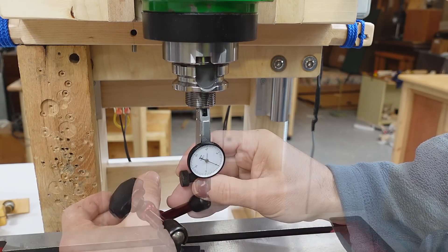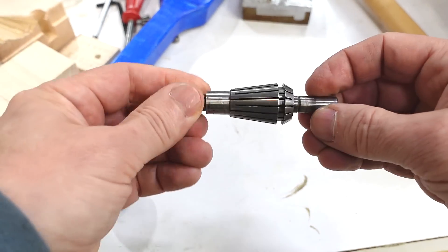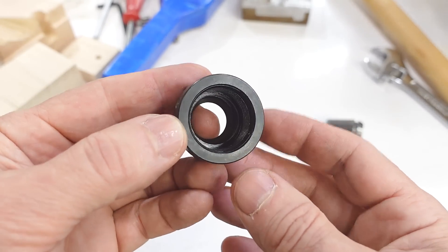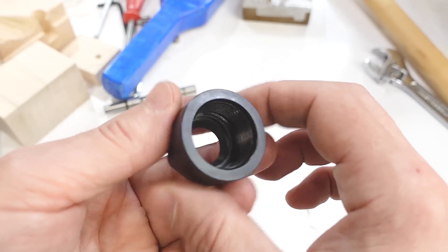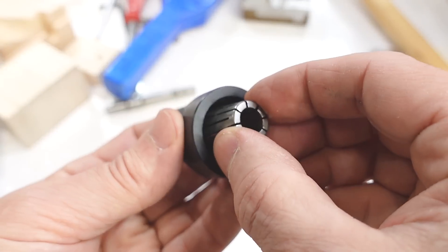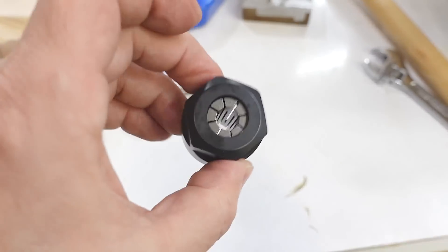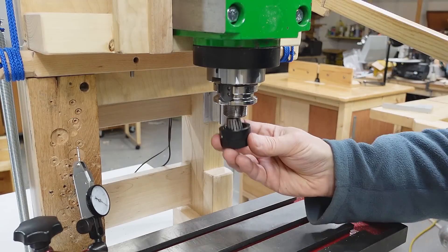Going a little deeper in there — if I'm that far off, it really should be quite visually obvious, and I don't see an obvious problem. Then I looked at the collet nut and noticed there's this ledge in here that is way, way off center. I thought how could I get this wrong, until I eventually realized you don't put these straight in — you have to hook them onto one side. It's a little tricky to get in, but then the collet actually sticks in there, and when you pull the nut off, that pulls the collet out too. So I've just been using it all wrong.